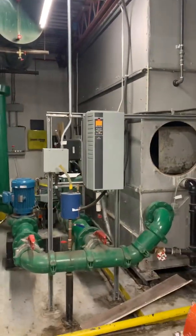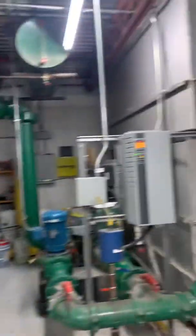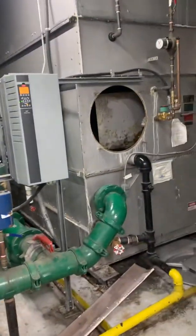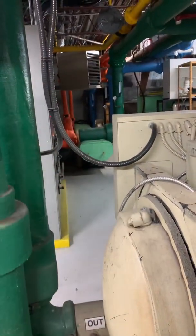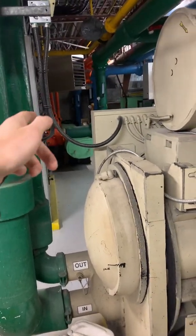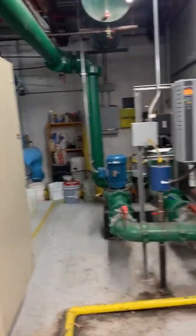It's kind of a different system. There are lots of different types of cooling towers — some just have water fill with sprayers and tubes holding the cooling fluid, where the water is constantly recirculated. They also have a chiller which kicks in above 15°C, and they have what we call the economizer coil plumbed in over there. It just uses cold water that the cooling tower puts out to chill the building in wintertime through a heat exchanger with the building water. In the wintertime the chiller's off but they still want cooling, so they call it economizing or free cooling. Water chills in the cooling tower, goes through the heat exchanger with the building water, and that's used for cooling in the building. You see a lot of different styles in different buildings — it's just how this one's set up. Not perfect, but it works.